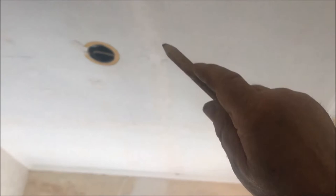We've got this ceiling here, fibrous plaster. I've re-screwed it all up, taken the straps off, done the joins and we're going to put an Art Deco ceiling panel up there.